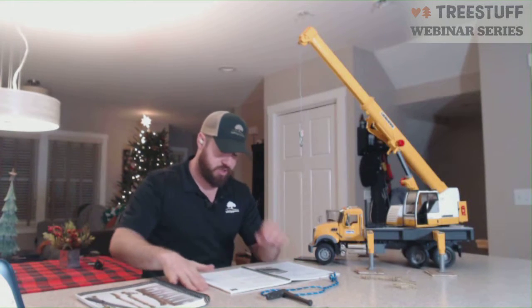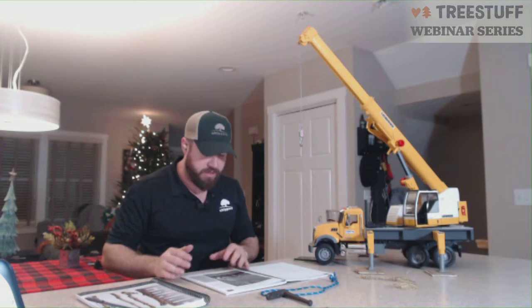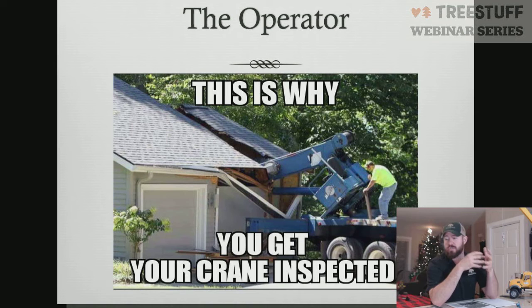All right, the operator. Operator is a crucial role in the tree care industry. I'm sure I'm going to spur on some conversation right now, but there was an exemption made by OSHA a few years back that made it where to operate a crane in the tree care industry, you did not have to be a licensed operator. That is only true in the event that you're operating and only picking up raw organic material. That was written in there for more of yarder cranes for logging operations. It was not meant with the intention of the arboriculture industry.